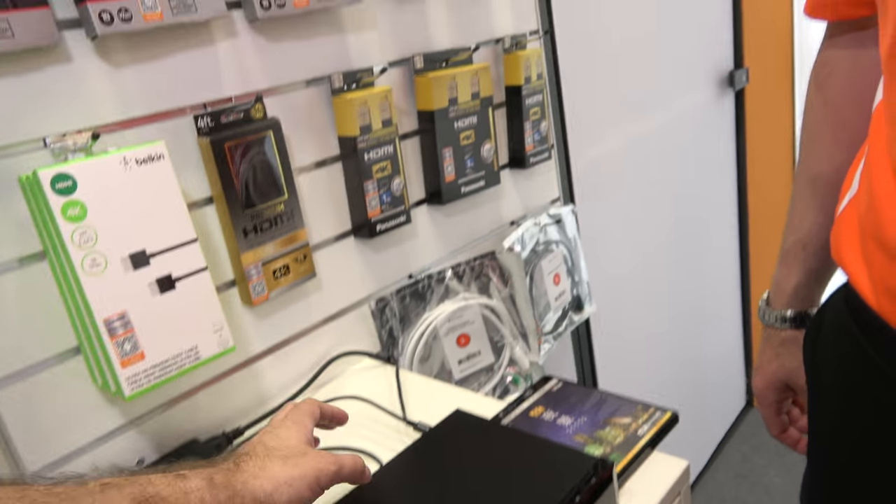The camcorder and this Blu-ray player already have HDMI chipsets in there, so it's just rerouting — that's easy. The SOCs, which are the system on a chip that already have HDMI built in, it's very easy to add some circuitry, a switch, and a PD controller that would transform that into a USB Type-C capable device.